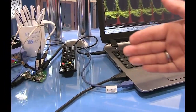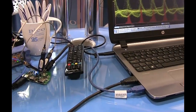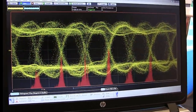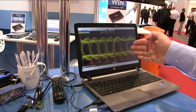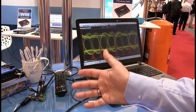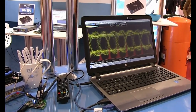What you really want to do is get in and see a signal live, such as that HDMI stream, so that you can debug quickly and efficiently just as you would with any ordinary oscilloscope — probing the function or malfunction of this system. So here we have the live HDMI data running at 1.4 gigabits per second on each of four lines. This is a real-world eye diagram, not one from a high-purity signal generator, but from a typical laptop and a rather low-cost HDMI switch.